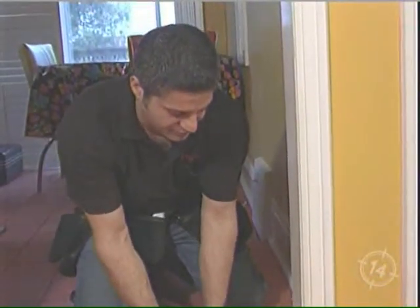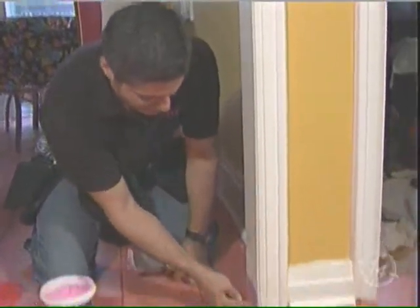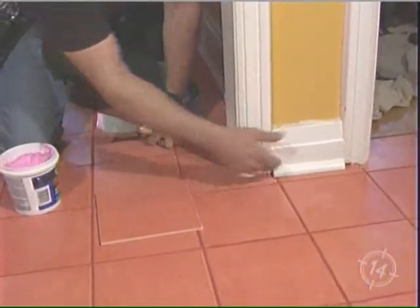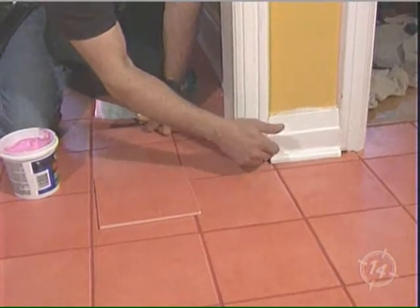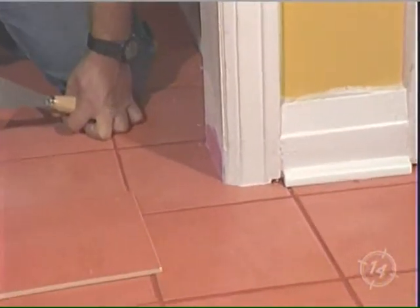What I like to do is use a special tool — it's called undercutting. So we undercut all of the jambs. Obviously there's no cord around; we've just installed that. But we undercut the baseboards, jambs, existing casings — everything.